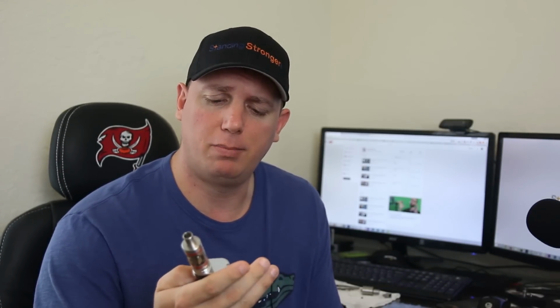I like it. So what I'm going to do is show you how I built this coil, but when I rebuild it, I was trying to get like 0.8 was my hope, because that's really where I like to vape. I'm going to try to go a little bit lower and see how that works out. So I'm hoping to get it down to about 0.5, 0.6, where the actual coil is when you get it. So, hey, let's get down and dirty and see how this thing works.